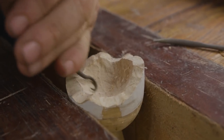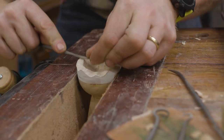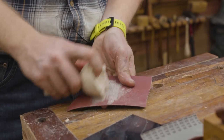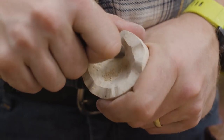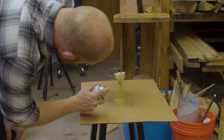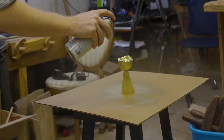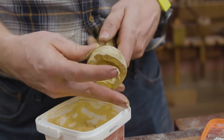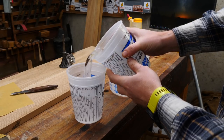That is about the shape, so everything from here is smoothing and detailing needed to cast this — if I cast it now you get all of the grain texture in the surface. I go with finer and finer rifflers on the edge; on the outside it's easy enough to sand it smooth — I took it up to around 400 grit. Card scrapers work phenomenally on the inside using a curved card scraper. Then I give it a coat of paint to show where anything needs to be filled and give it a smooth surface for molding. Once that dries I apply wood putty to any holes, divots, or grain, sand it down, and repeat — I went back and forth between those two steps about three times.